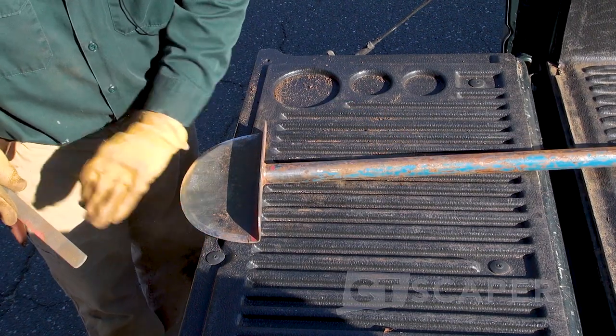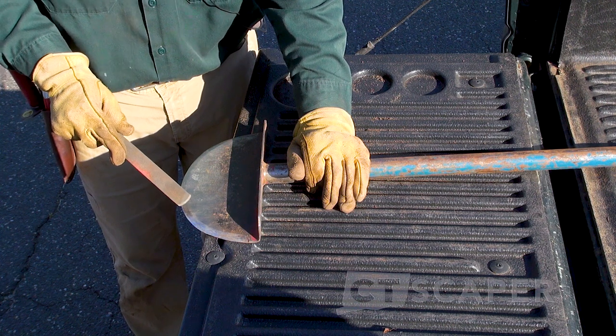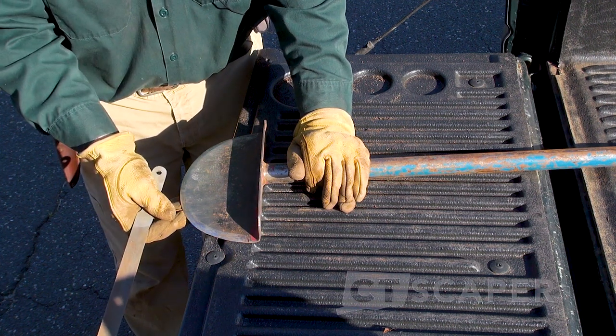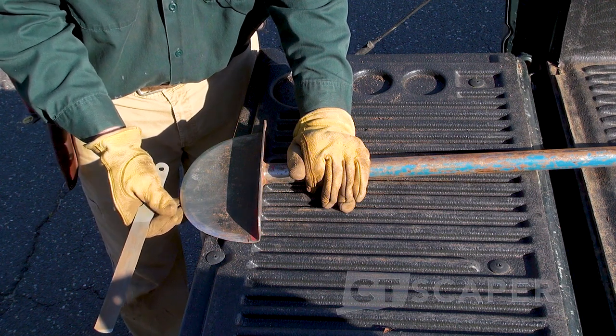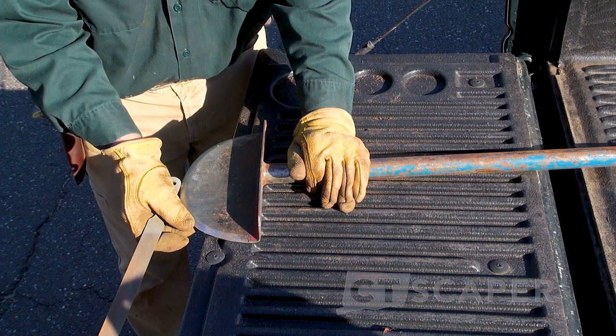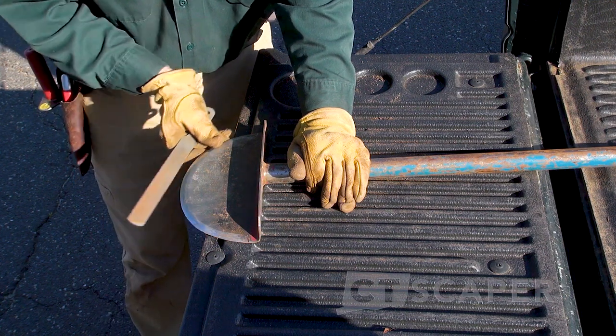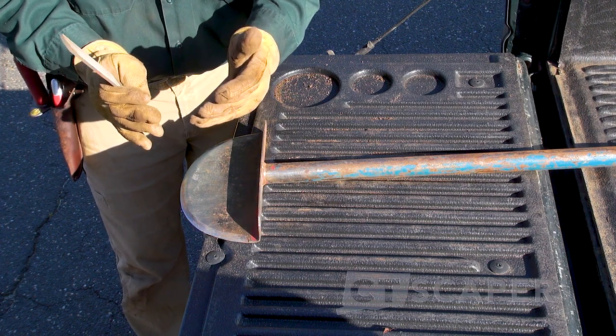What you can do is just look at your edge and you'll see where it's polished — that's how you'll know where it was sharpened. When we're sharpening here, we're not looking for a razor's edge, because a razor's edge is going to be more brittle. We just want to take any nicks out of it and make it come down to an edge, but not a super fine edge.